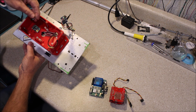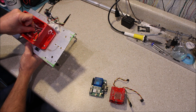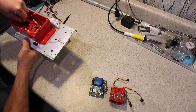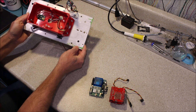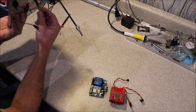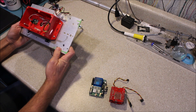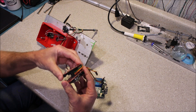So we can get that plugged back into channel one. Let's get the servo input power plugged into the same rail as well. The whole time we're keeping track of our polarities on these plugs because they are reversible on this style of header — signals are usually always in the middle, which helps. Now we've got these two labeled P and C, and those are the outputs from our steering mixer that we talked about in the earlier video.